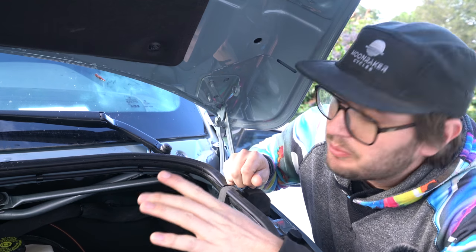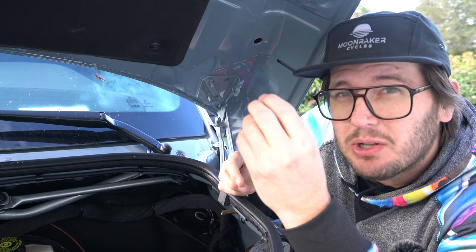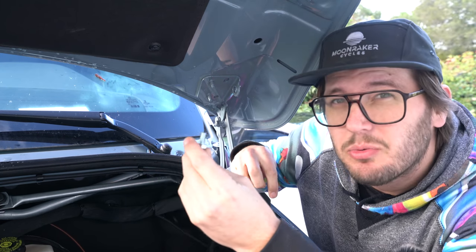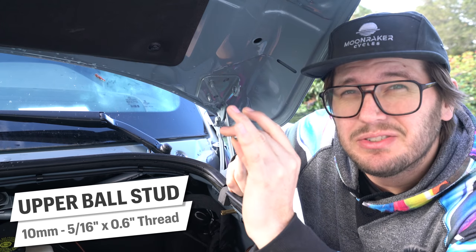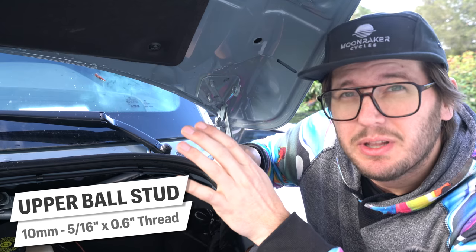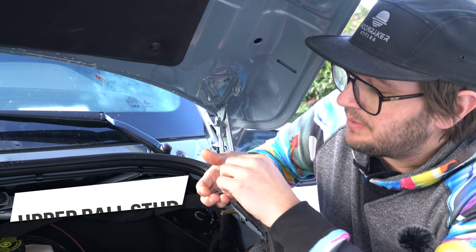For the upper strut support, we're going to be utilizing this factory hole right here. There's a few things we need to pull this off. One is this ball stud, which is a little bit different than the one we use below. The thread is slightly longer. I'm not completely sold on the hardware I'm using here. I will put a link in the description below, but as soon as I find something better, I'll update accordingly.